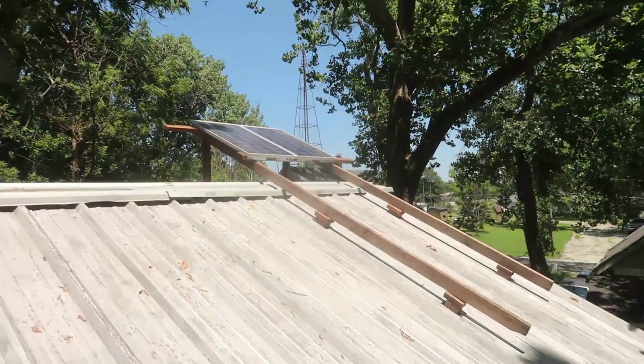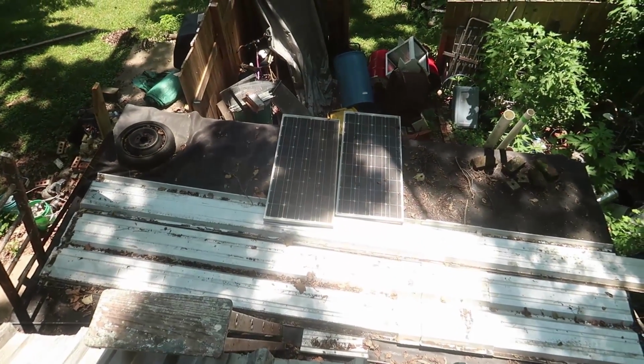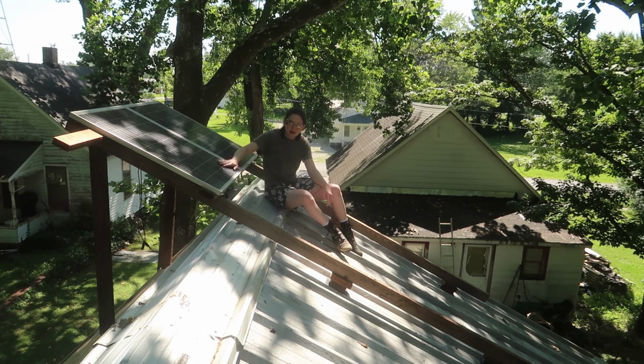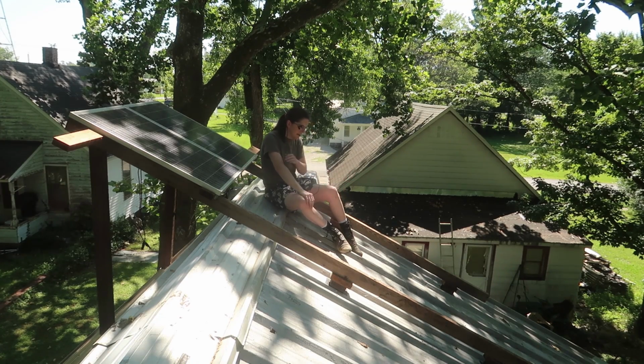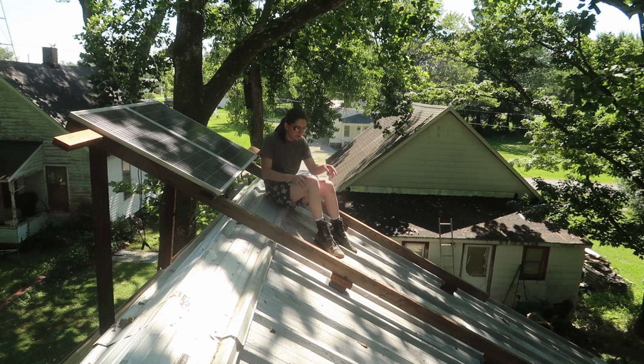These are two 100 watt panels, and I have two more. Although they were sold as 100 watt panels, I think they're most likely 80 watts because they're a little narrower than this. A little bit longer, but a little narrower. Those can go here too, temporarily, because they still sell ones this size, and so I'm going to get more, and I hope that I can, I think I probably can, extend these rails further down, and 600 watts or 800 watts for this row. I don't know, we'll slowly expand it two panels at a time and see what happens, but for now we can bring up those two panels and put them here and rig something up.